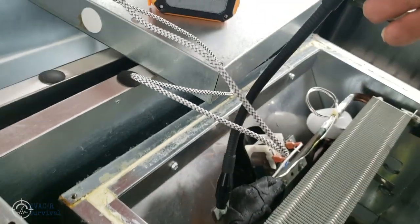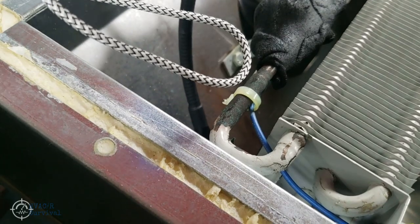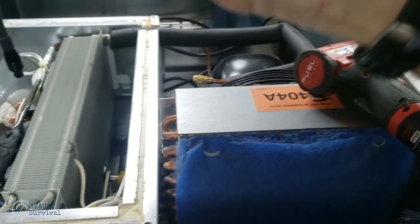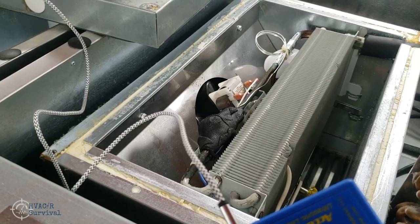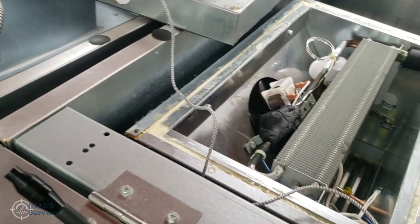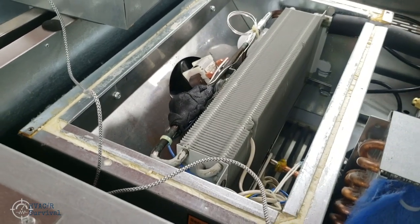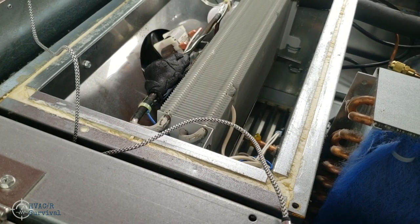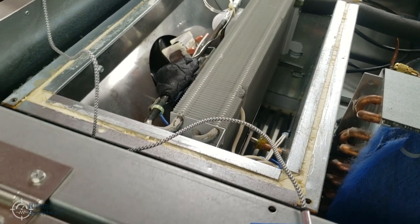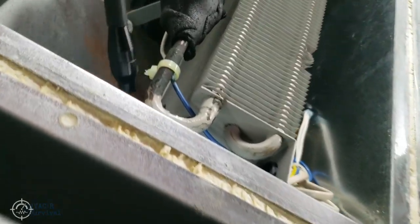This is one of the weirdest sounding things I've ever heard. I've unplugged the unit so there's no electrical noise causing this. The leak detector just couldn't narrow it down — it didn't matter whether I used high or low. It was somewhere in here, which is good enough to condemn the evaporator. But I want to know exactly where it's at, because sometimes you can be misled by leak detectors. This is where the gooseneck comes really in handy — it gets me narrowed down into tight spots.